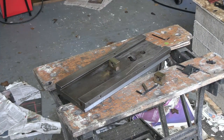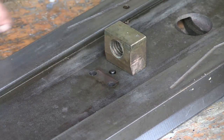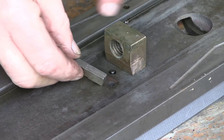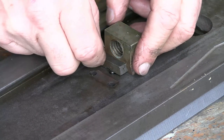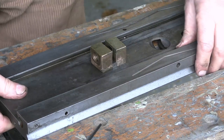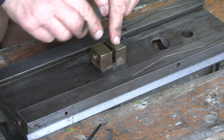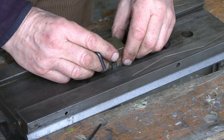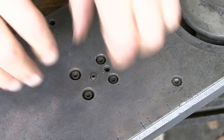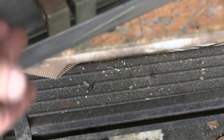I'm just putting the lead screw nuts back on the cross slide. This thing is bolted into position, and then there's this steel piece with a slot which engages with that grub screw. As we tighten that grub screw up, it's going to push this that way, thereby increasing the separation between the threads here and removing the backlash. I was wondering why these two holes were slightly larger than those two — that's to allow this bit to move and align itself with respect to that bit when the lead screw is in there.